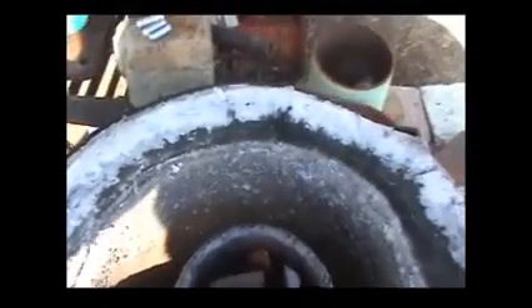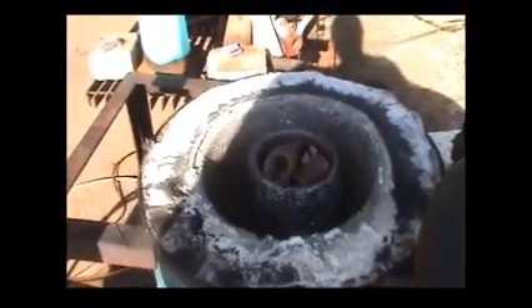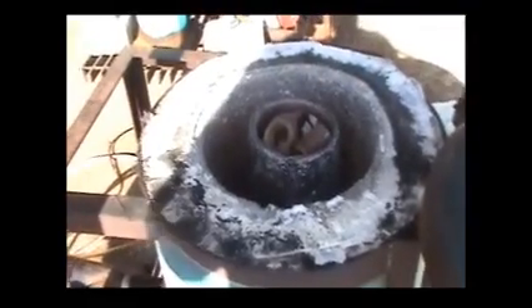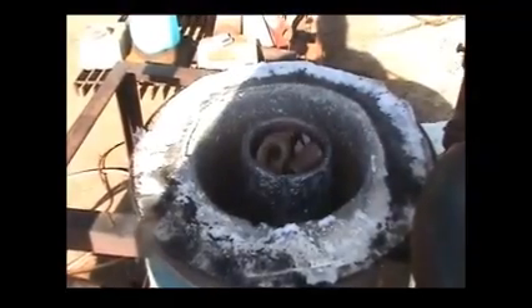All of this gray stuff — I had made some changes to my burner and was melting aluminum the other day, and that gray is aluminum that was getting whipped out of the crucible by the burner blower: the slag and dross that was floating in the crucible, because I had the blower wide open.